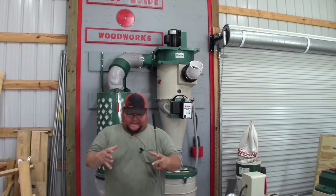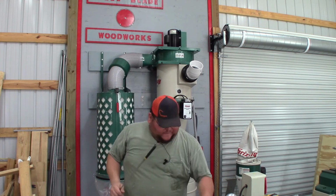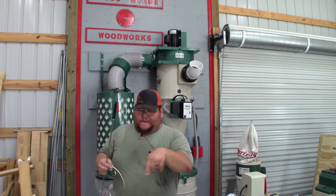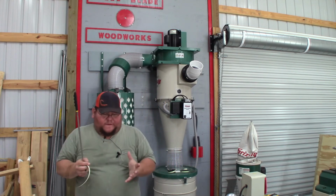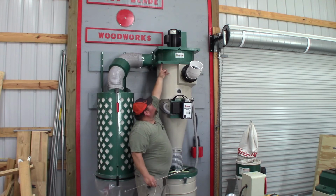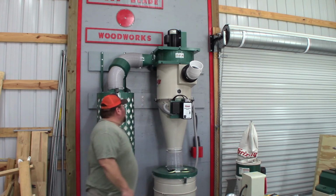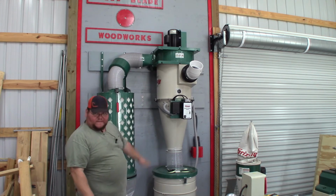And on the inside of that cylindrical, on the top side, on the flange, you have to put some of this foam sealant. And you'll see, per the instructions, it doesn't have a groove, it just tells you where to set it. So when it does mate up to the bottom side of this blower housing, it seals, and then you use your bolts with your Loctite and cinch it up. That's the only place that requires Loctite. It's just because you won't have access to it anymore.